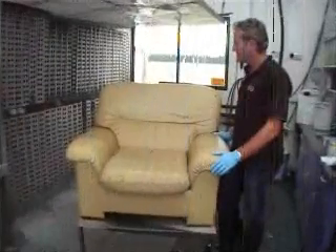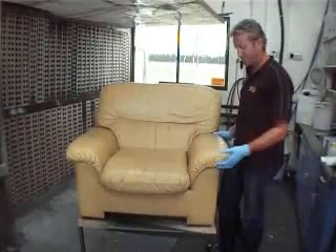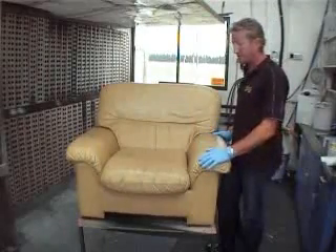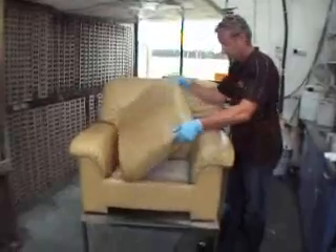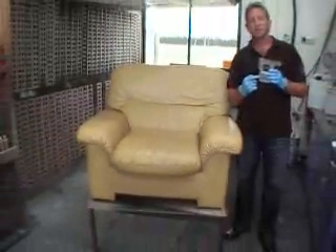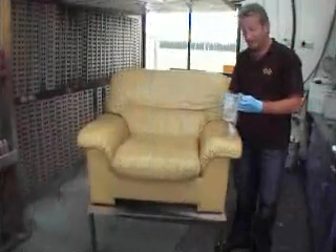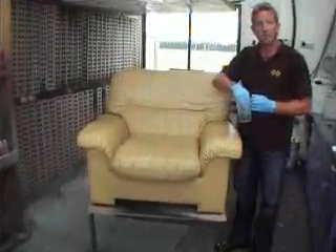The chair's all dried out now, so the next step is using the methylated spirits to prep the leather. This was a really filthy old one — we've gone out of our way to get a real clunger. We've taken so much dirt out of it. I've decided to wear gloves because I've been using meths. You can use the straight meths that has a slight blue tinge to it, which doesn't hurt at all. You use the brush and the scotch pad, which is provided with the kit.